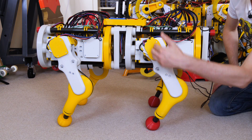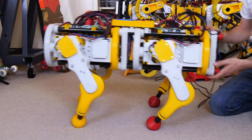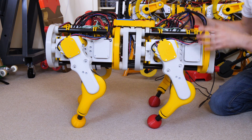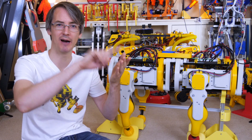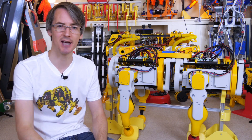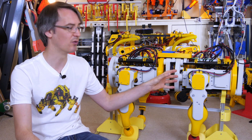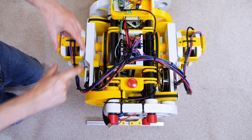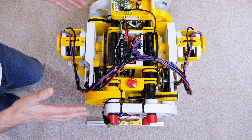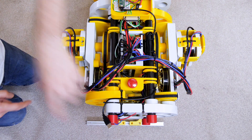If I reposition the legs to bring the foot directly under the shoulder, it has a much greater tendency to fall backwards and the legs will give way. So the first thing I'm going to do is turn around the back legs so they're symmetrical and the load is more evenly balanced. Those 3D printed pulleys make this build really accessible — they can be printed in PLA, and having the belt around the whole pulley means it grips on multiple teeth, so those pulleys will stand up to much more torque than 3D printed gears where only one or two teeth engage. Planetary gearboxes would give a bigger reduction in a smaller space, but then we'd have to make 12 of them and hope the gears don't strip when the dog jumps. So we're going to move these shoulders back to match the front legs — I've made this in a modular fashion so we can take the whole leg off, switch it around, and that brings the shoulder to the back.